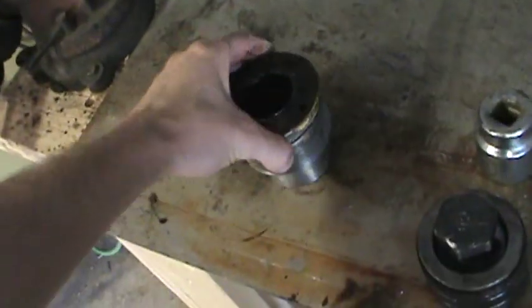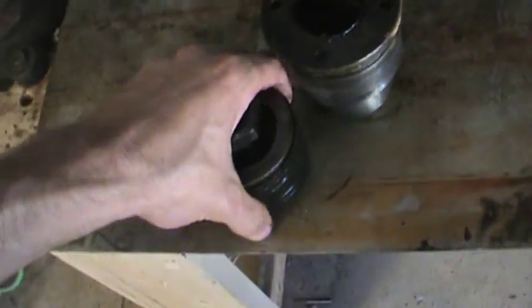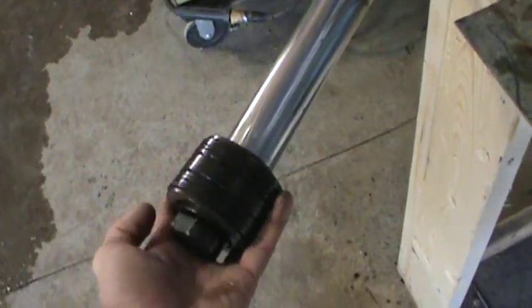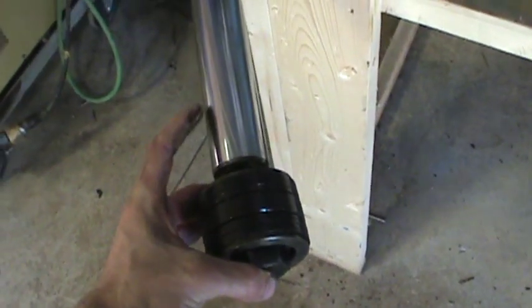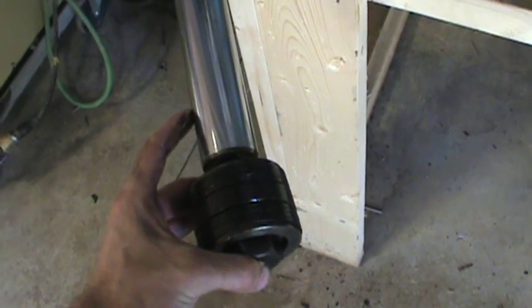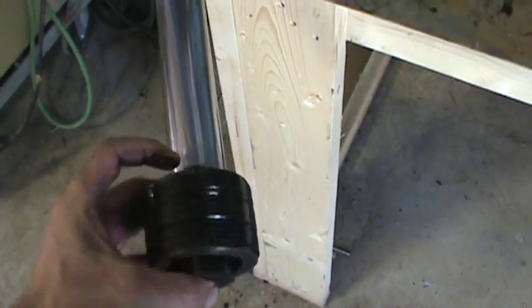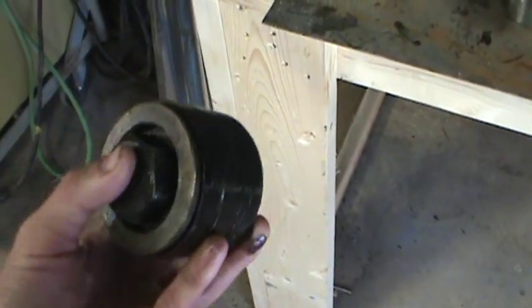This part on the top of the gland is just a wiper seal. You want to bring this with you to the seal store. These are just V-grooves — that one goes on the shaft and this will be threaded on the end of it. This is what grabs all your fluid. The fluid goes into the top towards my finger or the bottom towards my thumb, and it pushes one way — up or down — whichever way the fluid kicks in. If you're having weak cylinders, it's because of this.